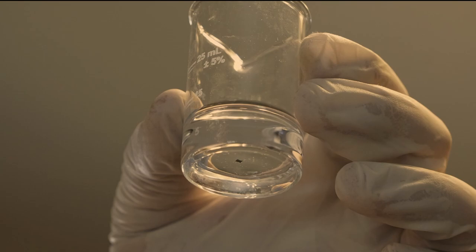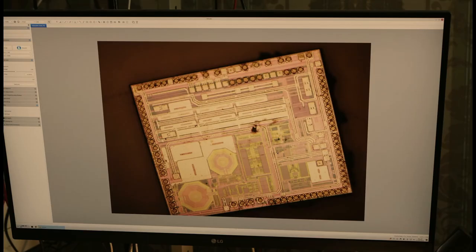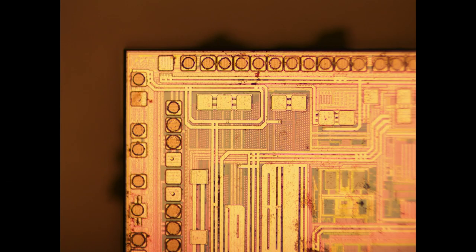Here's the glass — you can see it on the center of the microscope slide, and then we can photograph it. This is a tiny little chip under minimum magnification. Usually I need more detail than the camera can read at this level. So I take a series of photographs while moving the stage — move it just a little bit each time. I can take that series of photographs, line them up, and combine them into a panorama. With a ROM, I need to see all of the individual bits of the entire program in one photograph, so I'll take many photographs and combine them.